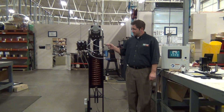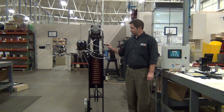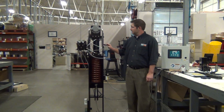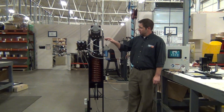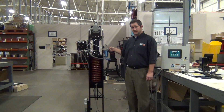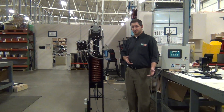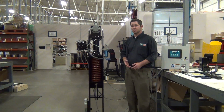This actuator's output is 10,000 pounds of force with a maximum travel of 6 inches. We have a servo motor and pump on the other side that transfer the oil from one side of the cylinder into the other when you make a position change, so there is no oil tank or reservoir system or filtration system as in other hydraulic actuator designs.